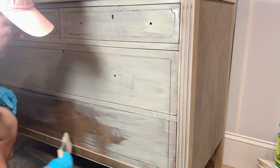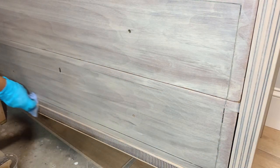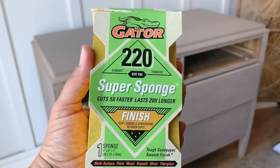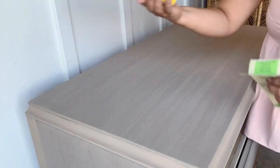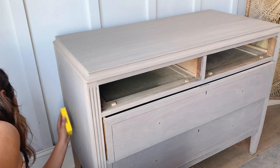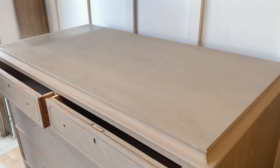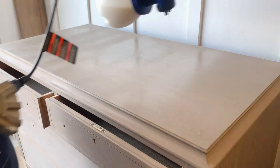When applying this technique, I like to work in sections — I did the top first, wiped it down, then did the drawers, waited a couple minutes, wiped them down, and moved to the sides. After applying a color wash, it's very common for the wood grain to raise, which means the surface is not very smooth. I'm addressing that by scuff sanding with a 220-grit super sponge from Gator. To remove sanding dust I'm using a tack cloth, and then we can finally top coat the piece to protect it. As always, I'm using my favorite High Performance Flat from General Finishes, spraying it with my HomeRight sprayer, applying a total of three coats.